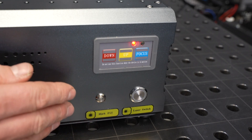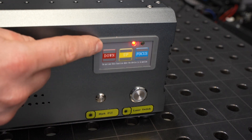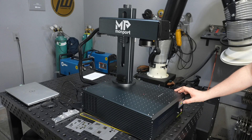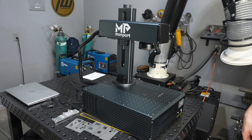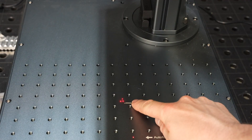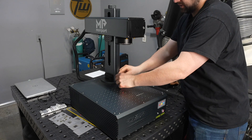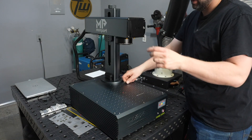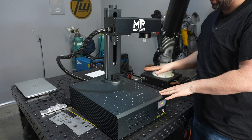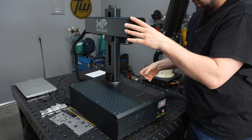There is no key switch or large emergency stop on this, so be aware of that. The laser head is on a motorized axis and that's what this control panel is for, so you have a manual up and down to move it around as well as an auto focus button. There's a three-point laser system to show when it's in focus on your actual work. If you want to engrave on larger objects you can loosen the screws on the top face and rotate the whole head over to the side, which allows you to engrave with nothing beneath it. You can build your own fixtures then rotate it back and lock it down — I think that's a nice feature.